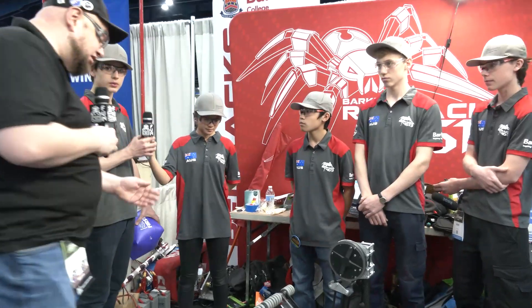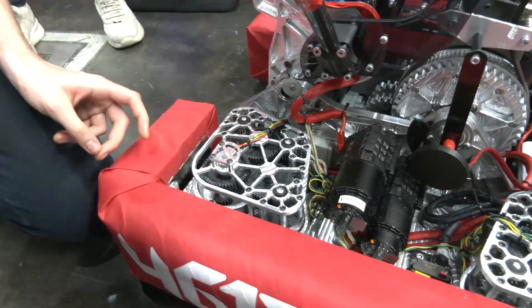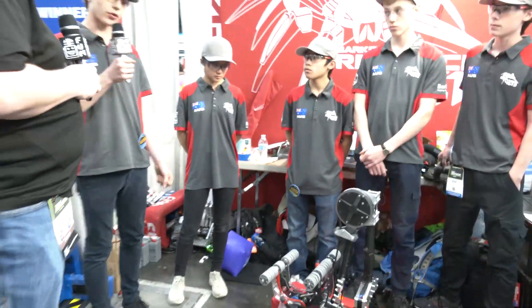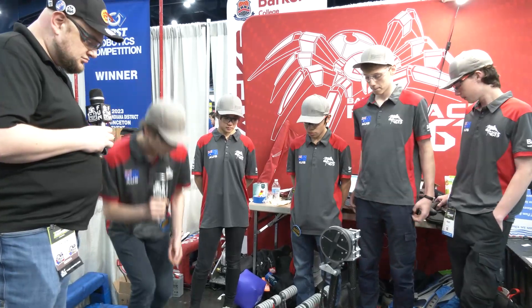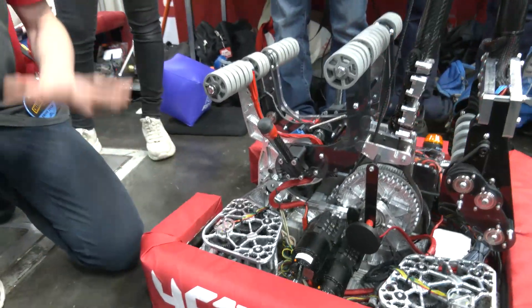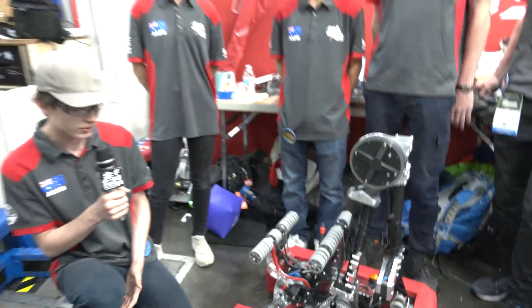You're doing some custom swerve on your robot this year, and you made your base a little bit bigger for championships. We originally had a two-motor swerve, the Mark 4i L3. Most of the parts are the same, but we changed these two gears and added an extra motor. This decreases our acceleration time and increases our max speed from 5.1 meters per second to 5.9. Adding the extra motor added about one inch in total to the frame perimeter. We mount our battery from the bottom because center of gravity was very important this season — we travel very fast and don't want to tip over. Mounting the battery at the bottom, and also mounting the Falcon modules below the plate, decreases that center of gravity.